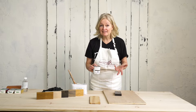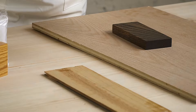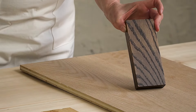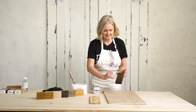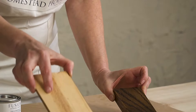The Stain and Finishing Oil will look different on different types of woods due to the softness of the wood. Pine, which is very soft, is going to absorb a lot of the pigment. Harder woods such as oak won't absorb nearly as much. You'll also find differences in the grain — oak has a lovely grain, while pine does not as much. That's how your main differences are going to be seen.